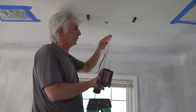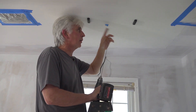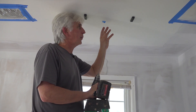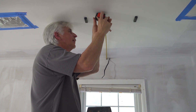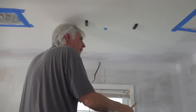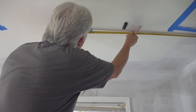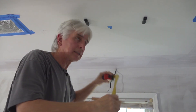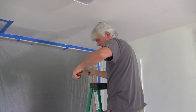We're going to take this insulation wire and drill it through — stick it up into the attic — so we can feel around and make sure there's no rat run or other obstruction above this location. I'd hate to cut a big hole and then find something's in the way. Let's measure: that's 36 inches, which is what Brian and I had measured out. And 43 inches — right there. We want to make sure these two line up and we confirm 36.